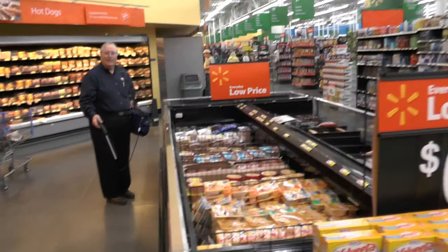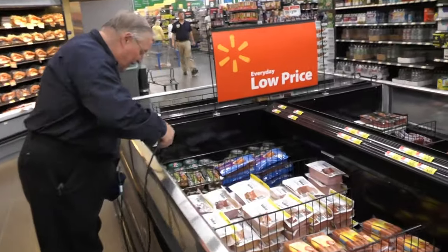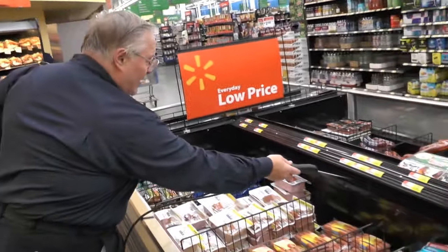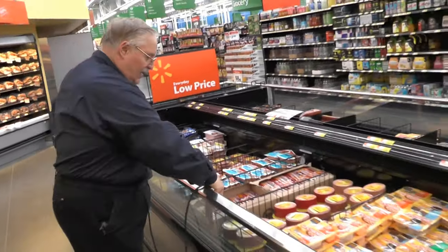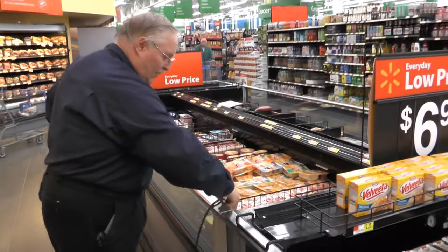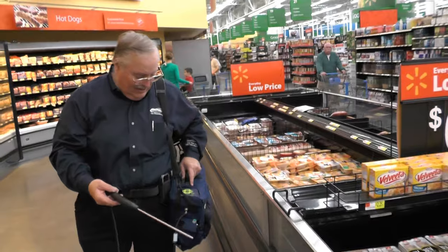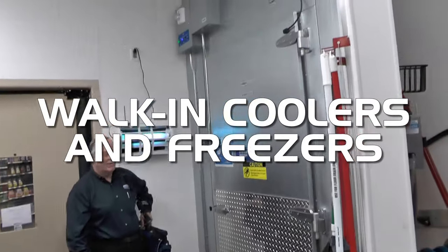The other way to test these cases is pretty much like the drop-and-stroll method. I'm going to check the front here and also check the supply area in the back. I'm just zig-zagging my way down this case to see if we have anything coming out of the front or the supply in the back. Any hit at all is a bad thing because we shouldn't have any gas in there, and this case is nice and tight.